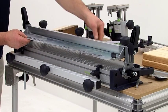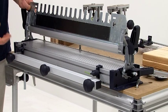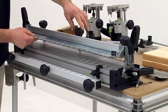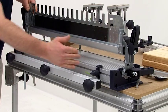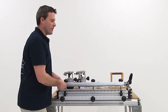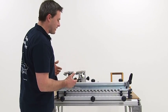In the front and rear area we have clamping bars to fix my workpiece. With long workpieces, for example cabinet sides, I have the option to remove the screw in the middle in order to work until a depth of 60 cm. When you work on the sides of drawers, you previously have to adjust the spacing.